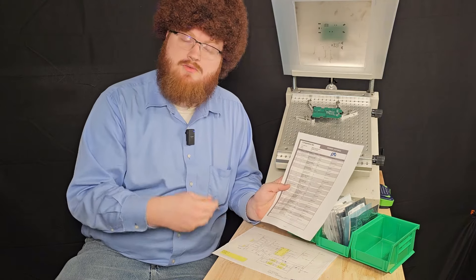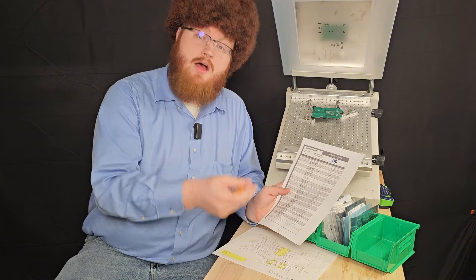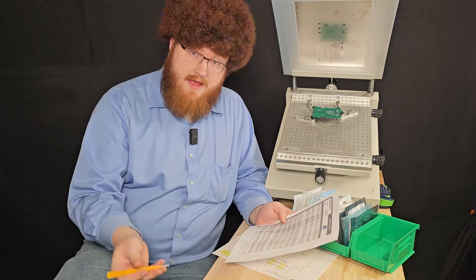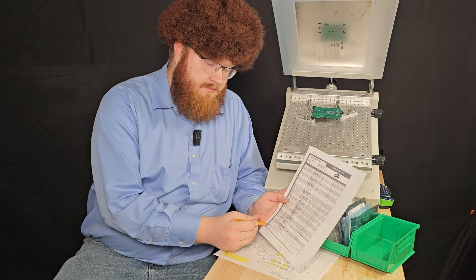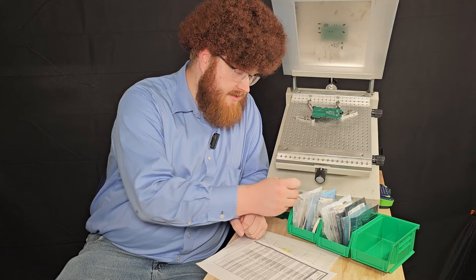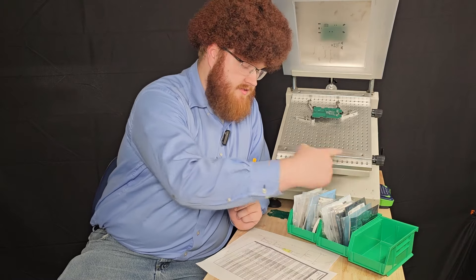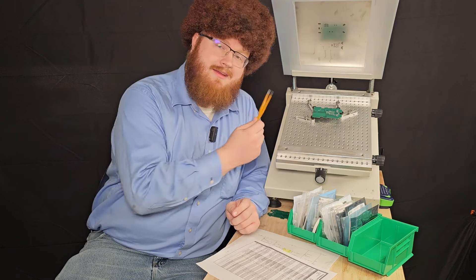So in this one, diodes are first — I'll do those third. Then a fuse, but I'll skip that for right now because it's on the top side of the PCB, not the bottom we're assembling now. Then I'll do my FETs normally, but those are also on the top side of the BMS, so we'll be skipping those. Then my main control chipset — we'll be putting that on. Then my two connectors, which will be on the bottom side. I'll keep everything organized in these bins, and when I'm done with one component I'll move it to the empty bin.